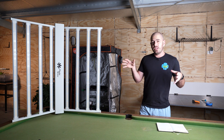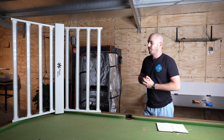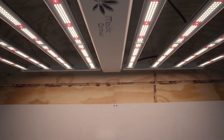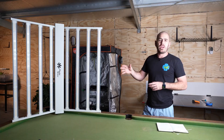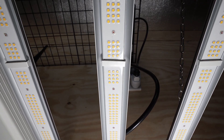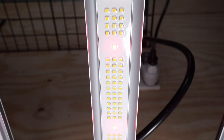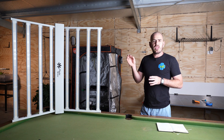This is obviously a rather large fixture and I'm really glad I expanded my grow test area because I'm going to have to max it out. This is the MedicGrow Smart 8 — an eight-bar LED full spectrum grow light with a claimed efficacy of 2.8 micromoles per joule. It's running a total of 2,960 diodes across the eight bars, made up of a range of Samsung and Osram diodes, with the Osrams being the 660 nanometer diodes. The diodes are powered by two separate drivers.